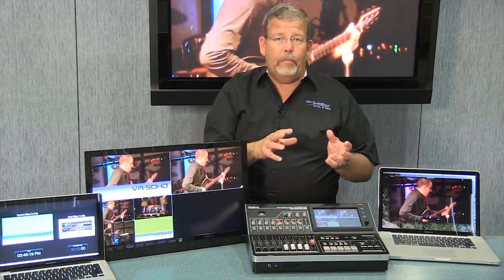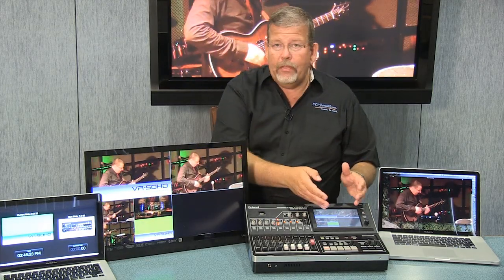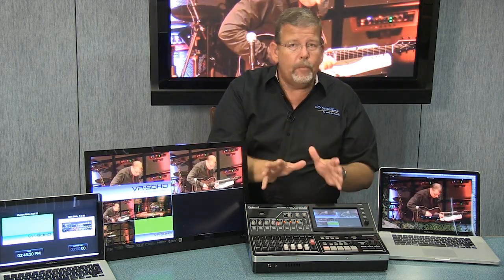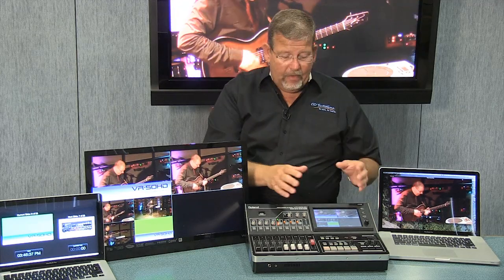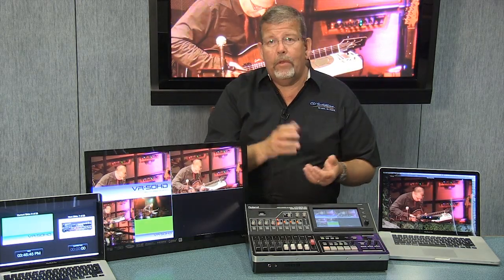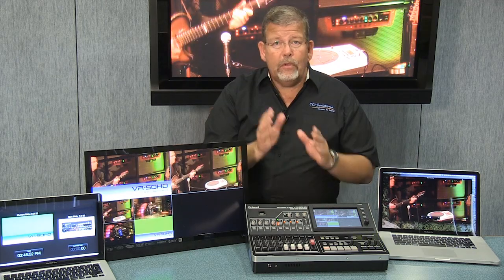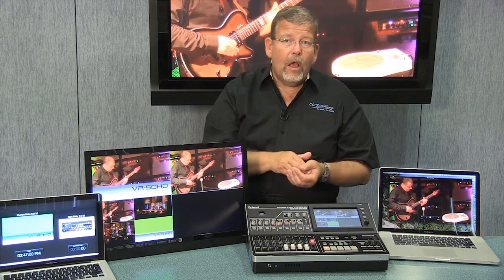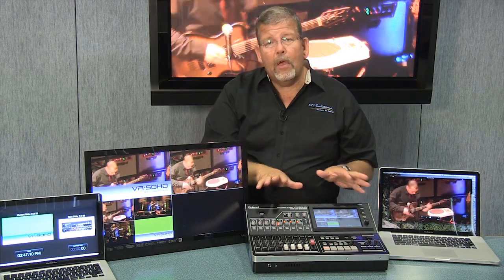All the inputs and outputs on the back are easily accessible by the touch panel. You can easily operate this and get a super professional production with easy operations — it's not hard to understand and you won't get lost, but it does have a lot of capability. The audio mixer has three-band EQ on each mic input — one full parametric and a couple of semi-parametrics. You've got delay on all audio inputs so you can synchronize audio with video, and a separate audio sync for the aux output for a foyer or delay feed.